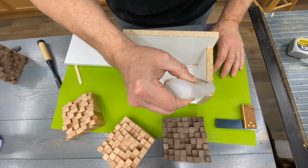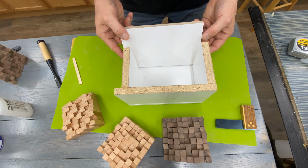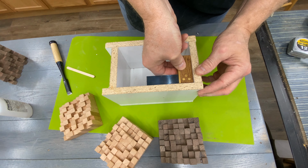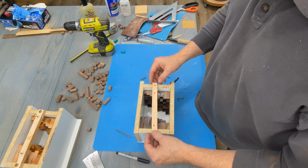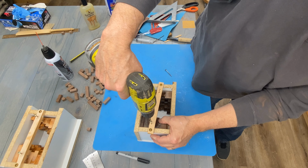In preparation for the pour, I built up my box forms with this melamine shelf material, gluing the forms together and sealing the backsides of each joint with some more hot glue. A thin top plate and some hold-down screws would help keep the blocks from floating or moving, and then it was ready for the vacuum chamber.